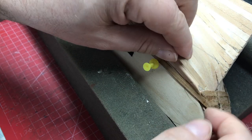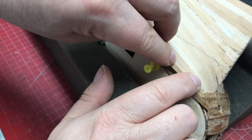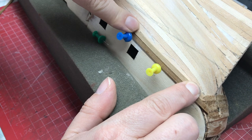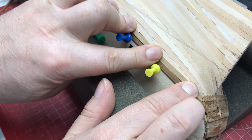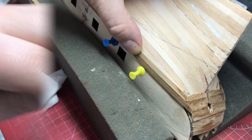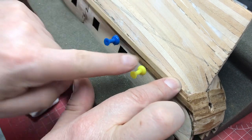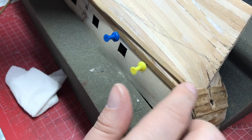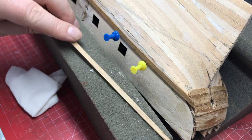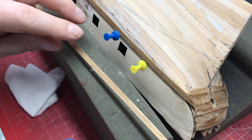I need to put a little twist in there because it's lying quite flat, which is how we want it to be. I'm going to go and steam that in. I've put my twist in and we can see how it's now sitting in place, so I'm ready to glue it in. I'm not worried about it being a little damp from steaming - with CA glue it actually sticks better if the plank's damp. So we're just going to put a little bit on this one end and start it off.